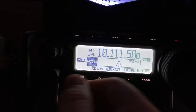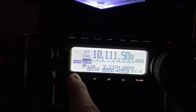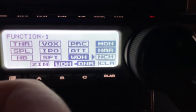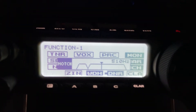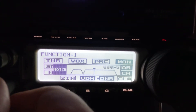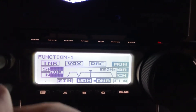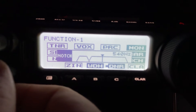Width: 50 hertz. Digital noise reduction. Now I'm going to go into the function menu here and you'll see that I've got — there's notch. That's the manual notch filter, engaging it at 510 hertz. It always defaults up here. I kind of wish it would default back to a lesser setting. So you can tell there, I've got my pitch set at 550 hertz. So when that filter hits 550 hertz, it knocks it down.